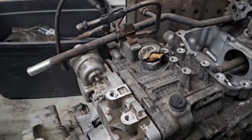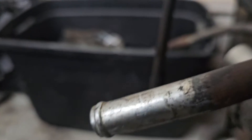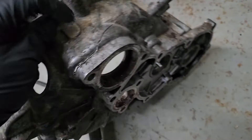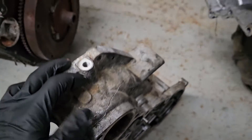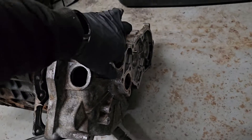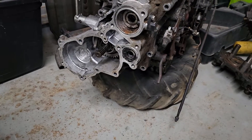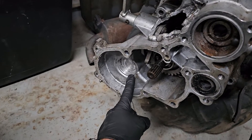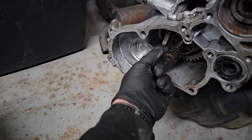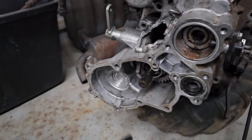There's a couple of alignment pins. So this guy's transmission blew up - you can see a big crack right there. This is his old transmission housing. He sent it along, and this would bolt up on here. If this is in your machine, this is what you see. On this side, your four-wheel drive gear goes down here, and your four-wheel drive output shaft is down there - that would go up to the four-wheel drive unit. There's a little shift lever, so when you shift your four-wheel drive, it's going to kick a gear basically into that four-wheel drive mode.